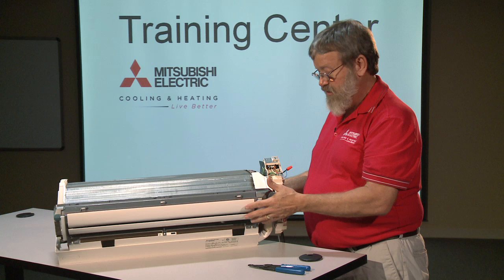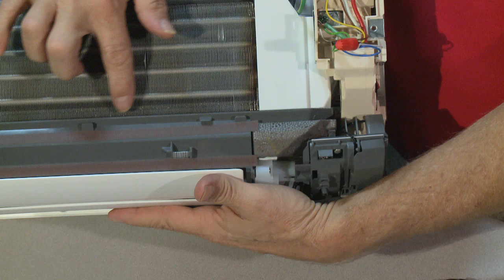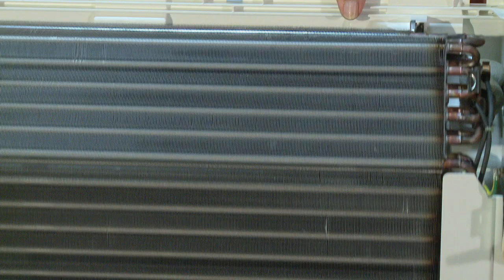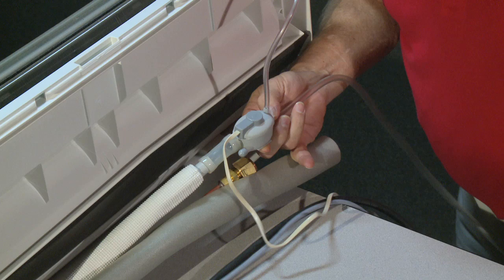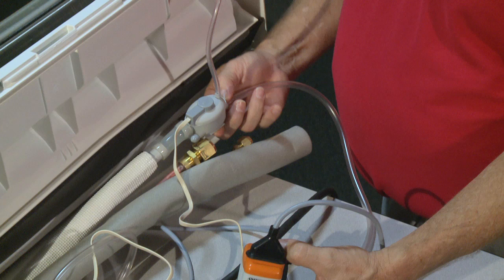If all this is correct and you're ready to power up — when you power up, add water to your evaporator to fill up your drain pan. One cup will do. What happens next is when this float switch pops up, the pump will energize, pumping water out to wherever you decide to pump it to.